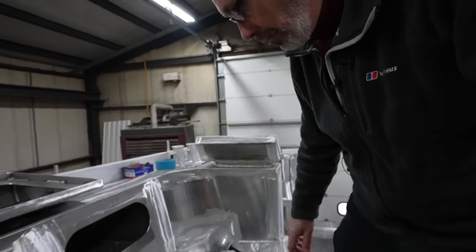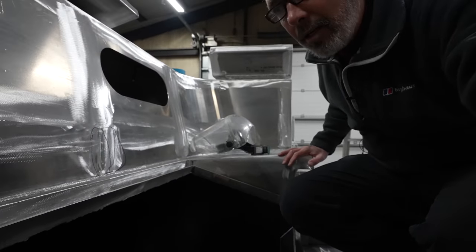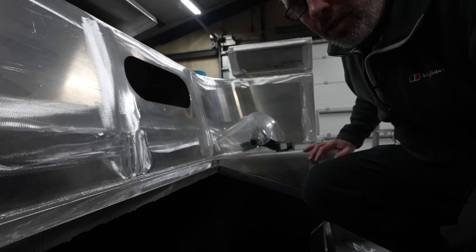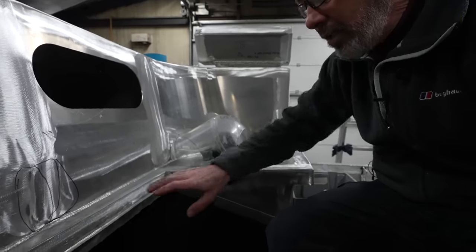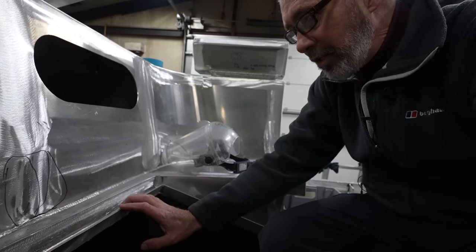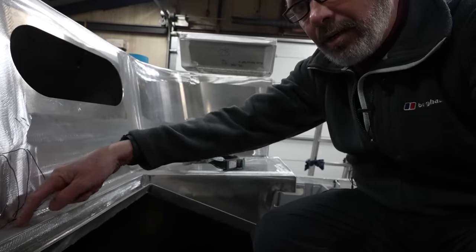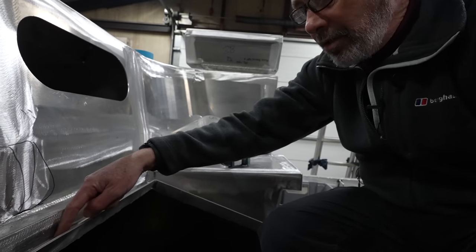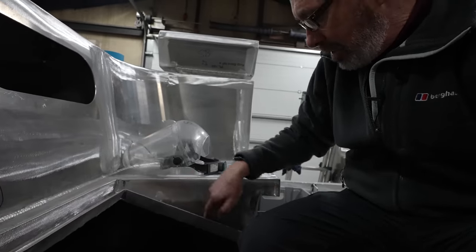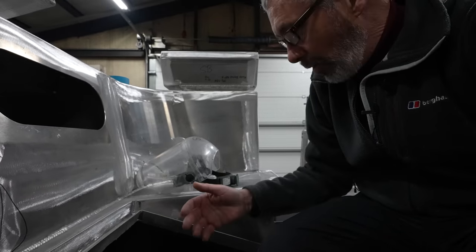Here's a good example of the design to combat corrosion. You don't want to ever have water pooling on the deck - that's really the same with other boats, wooden boats especially. You want to design so that any water that comes down here goes into the trough and drains down directly, because everything has an angle to it to minimize the amount of pooling water.